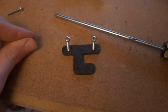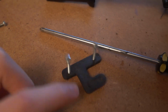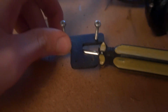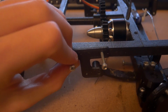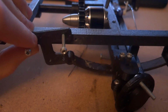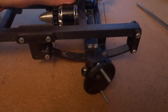So this is the next component you need to take. You only need 3 bolts for this, because this one is not necessary on the build, which I'm giving away for free on Thingiverse. This mounts through this hole here and this hole here, and it goes on this way around. Make sure you get the right way around, and you just need to bolt that through the axle, put one on the other side as well, and that will hold the front suspension on fully. The front half of the truck is done.